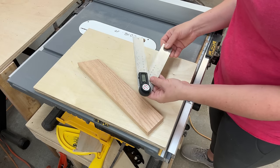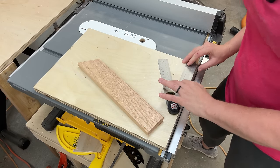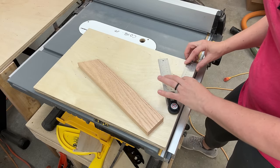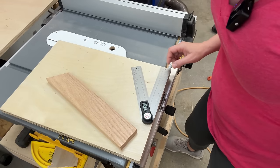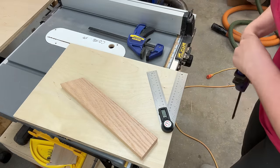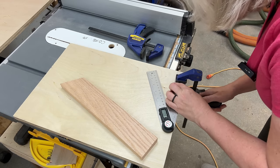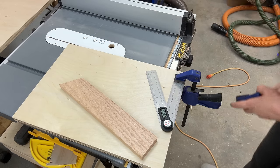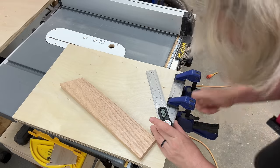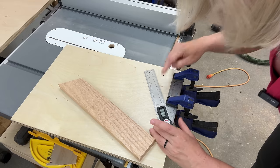Our ruler is now locked at 30 degrees. I'll line it up with the bottom of my plywood — I've already made sure all edges are square. I'll slide it off the working table and use two clamps to temporarily clamp it so it doesn't move. Make sure it's really flush; you do not want to be off even half a degree. Everything has to be completely precise. I'm running my finger along to make sure I'm flush — and I am. It's looking good; we are still at 30 degrees.